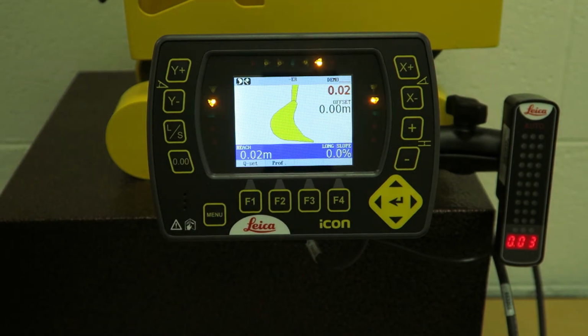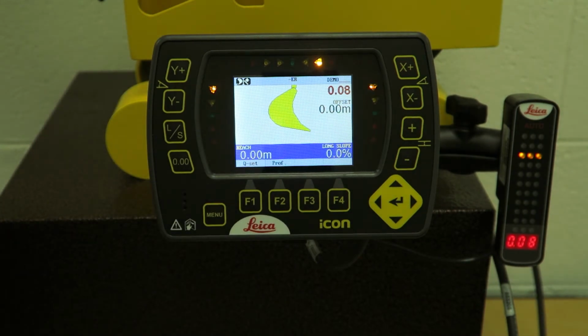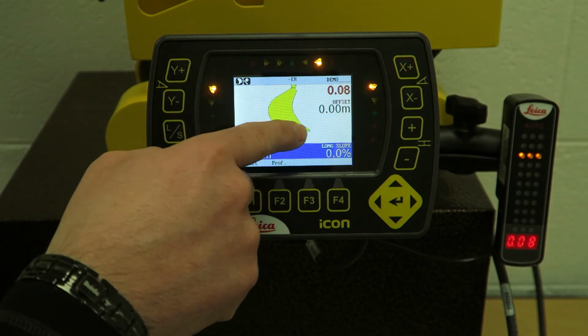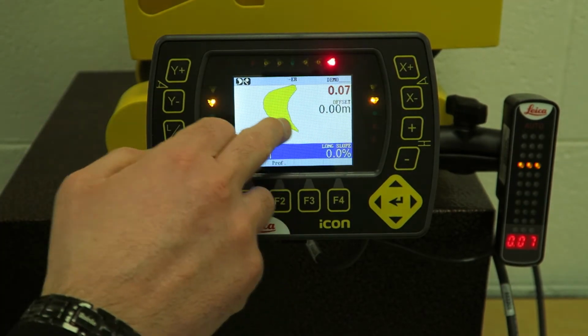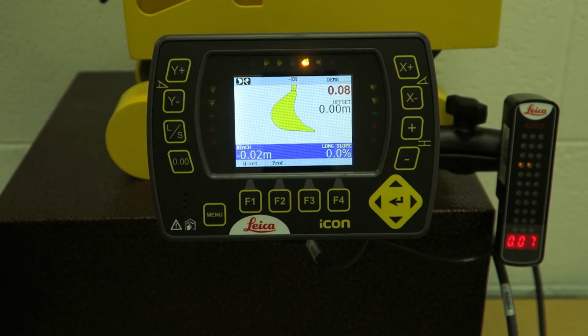Okay, again, if I'm high, there's a gap between your bucket point and your grade, which is your blue bar. The LED up the top is representing your bucket flatness, so the actual flatness of the bottom of the bucket itself. As you can see, exaggerating it there, it's nowhere near flat. I curl the bucket in, get the bottom of it flat, and the green LED will indicate. It's handy if you're benching, so you know that the bucket is in the same position as you did.